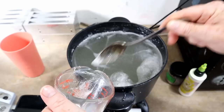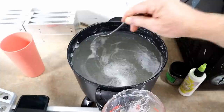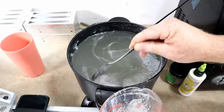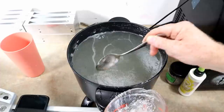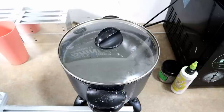Whenever I'm cooking plastic in the pot, I usually transfer it straight from the bucket to the pot, so it doesn't go in the vac at any point during the process. If your plastic sits in a garage with temperature fluctuations — particularly in Florida with lots of rain and humidity — moisture gets in and you're going to have these bubbles that cook off. You can kind of scoop some out to get that top layer off, because those bubbles will cook to the top and thicken up, and you just want to get those out.